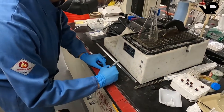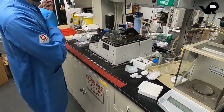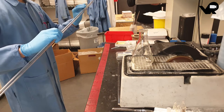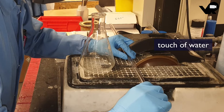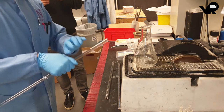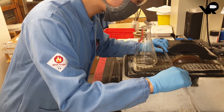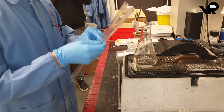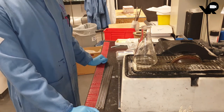Since I typically use tubes that are 8 inches long, I mark all 6 of those increments. Then, I score the rod using our diamond saw at every other mark, or every 16 inches. Scoring even lines without breaking through and adding just a touch of water helps the rod snap evenly. From a 4-foot rod, I should end up with 3 16-inch rods, marked down the center.